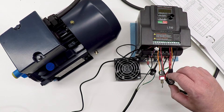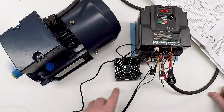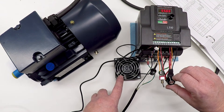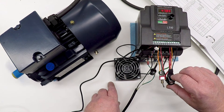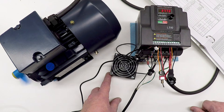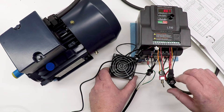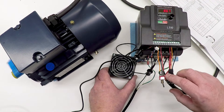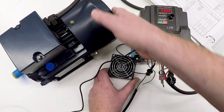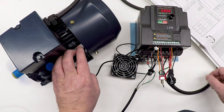I'm dialing below 40 hertz now but the motor isn't actually running yet, so let's set it around 60 hertz and start the motor. The fan came on briefly while it was below the threshold, but now we're up around 59 hertz and the fan has stopped. As I dial down — 55, 50 — when we hit 40 hertz the fan comes on. At 37 hertz the cooling fan is running and pushing a lot of air. Running all the way down to 8 hertz the fan is still going, cooling the motor, and when we get back up to a speed where the motor's own fan generates enough air, the external fan shuts off. Exactly what we want.